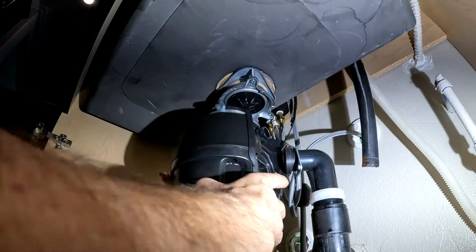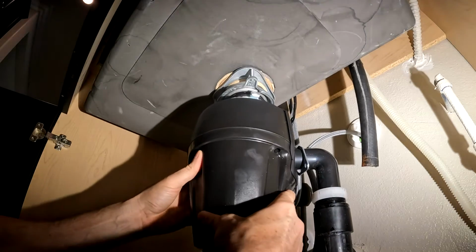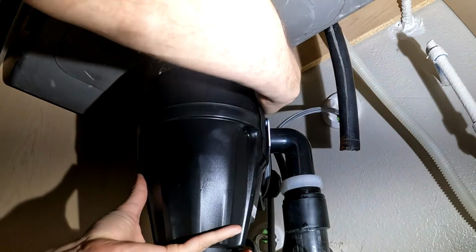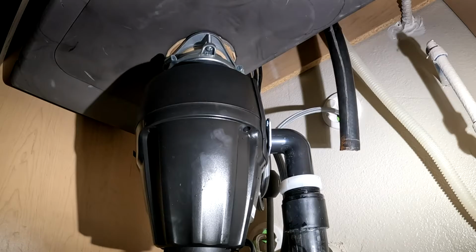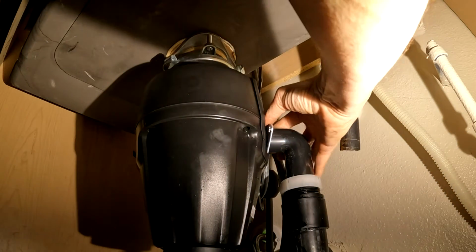Now, just take the new garbage disposal and latch it onto the existing frame. I do this all the time and yet to have an issue with it not fitting right, or there's a leak, as long as there's not a leak before. Don't tighten it all the way. We might have to align the L pipe with its fitting. And screw it down tight.